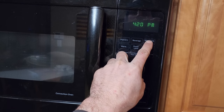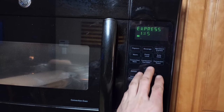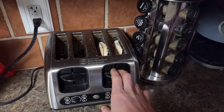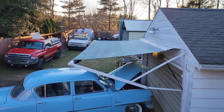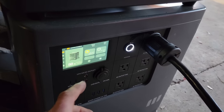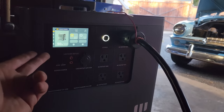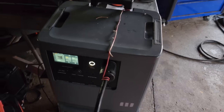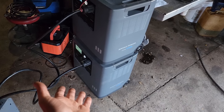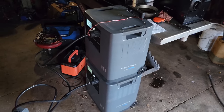Yep, cool. Made a slightly different noise in the beginning. I think I might even brew some coffee. While that's brewing, I'm going to fire up the toaster. Silence — no generator. As far as load, the bottom one's pulling 2,950 watts and the upper only 114. You've got to be conscious about distributing the load across these, because my entire kitchen is only on one hot leg. It's actually better this way since that one has higher percentage anyway, but something you'd have to keep an eye on — you want to distribute those evenly.